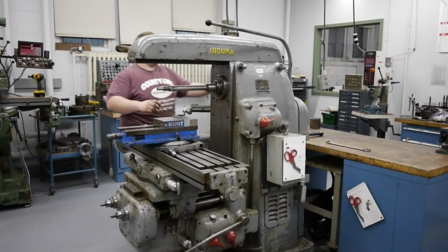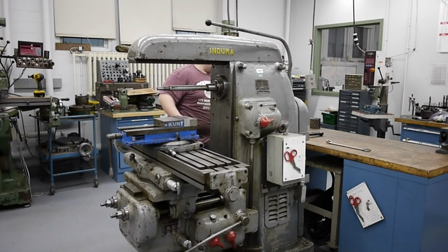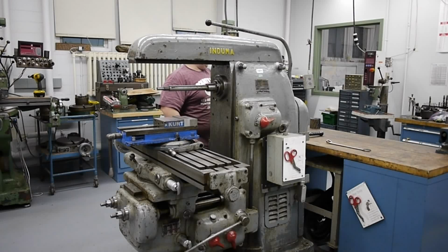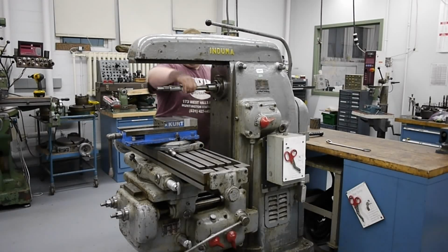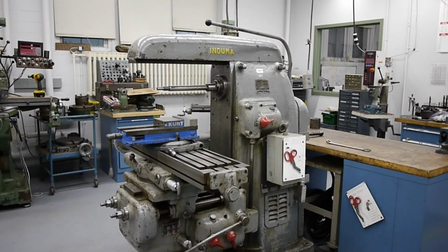and then from there we can go into the back of the machine, threading the drawbar so it's tight, and we'll go ahead and make sure that's tight. Grab the 15/16 locking wrench for this, and go ahead and tighten that arbor in position with the machine in a low gear. Now that arbor is tight, we'll go ahead and wipe any chips or oil off of this arbor. Go ahead and take our key, our cutter, and some of our spacers for this, and we will install them onto the machine.